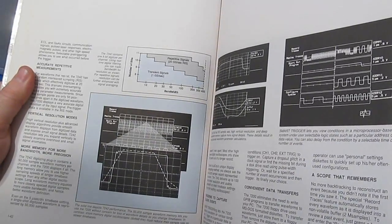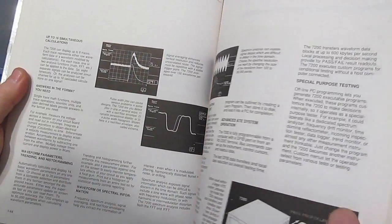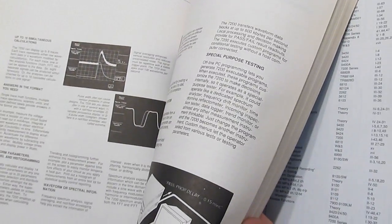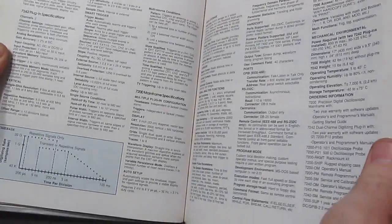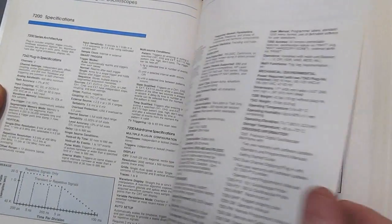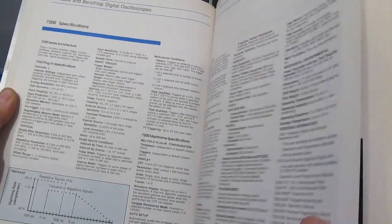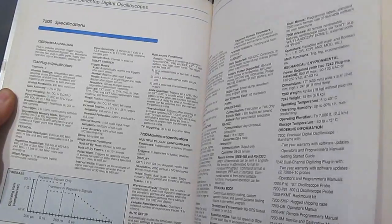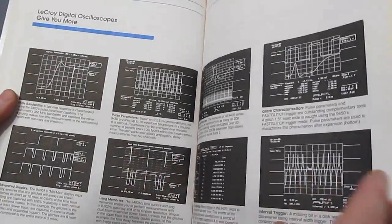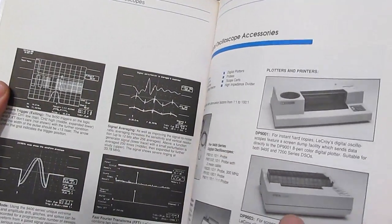I think I purchased that scope probably 15 years ago. And it really hasn't given me a whole lot of problems. I keep it around because if I'm working on something that is really high risk, like for example a high voltage scope probe, or I'm playing around with ignition sources or something, I'll typically use that oscilloscope. The reason is because I figure it doesn't really owe me anything at this point. If I damage it, I'm not really out a whole lot. The other thing too is it's more than capable of looking at high-speed signals like that.